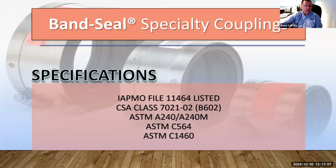Band seals. So we are certified, obviously, to IAPMO file 11464. We also are certified to Canada, which is the B602 per the CSA. ASTM steel is an A240. And obviously the polymer is standard and certified to ASTM C564. The standard for the coupling is C1460.